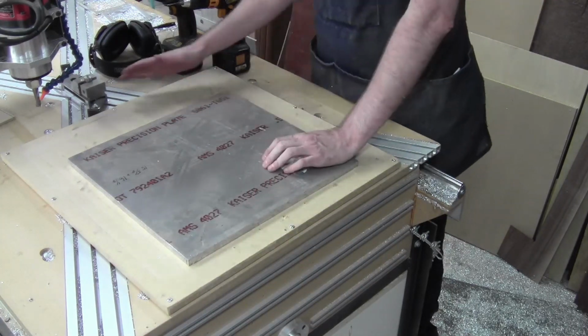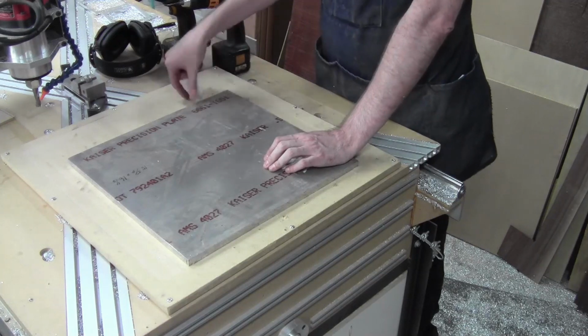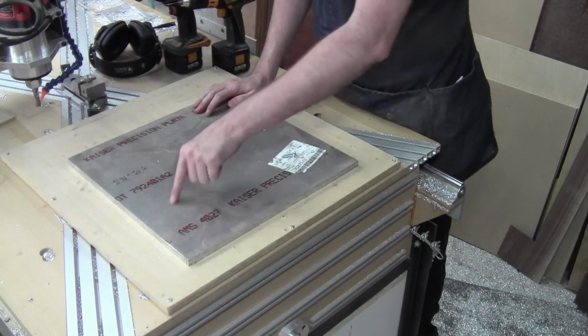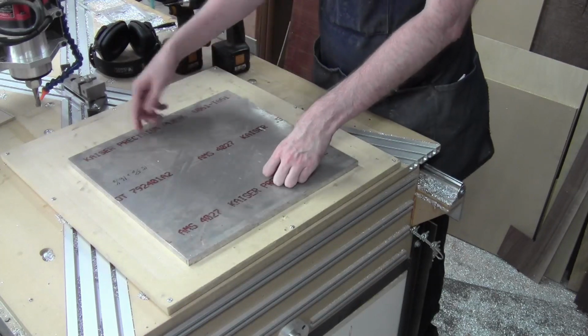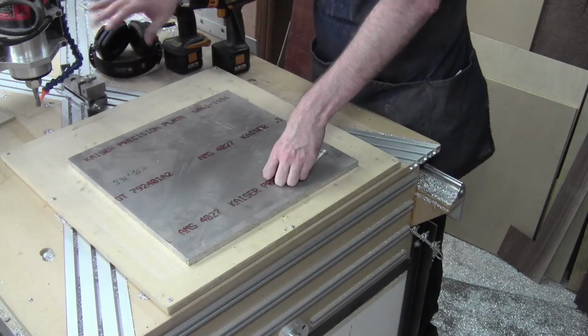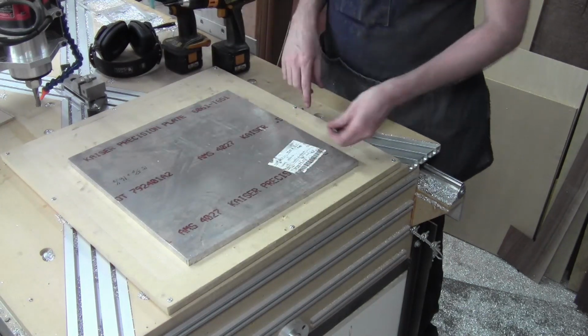What I'm worried about is the way I've been doing the screws, having the washer pushing, that's putting a bit of force this direction. So when this cut's clear, that's going to push this offcut into the cutter. Bad idea. And jam it all up and it'd be a mess. Trying to predict that ahead of time.